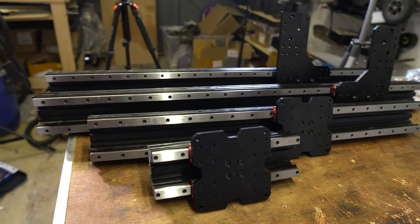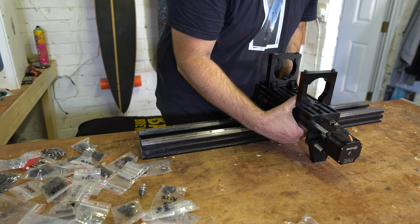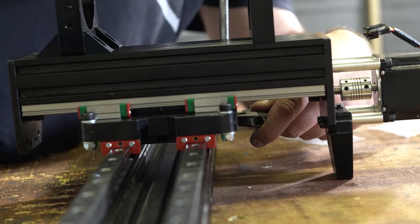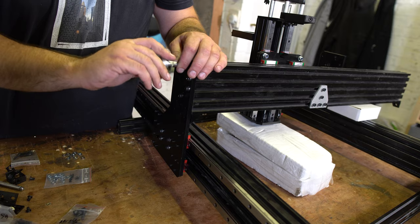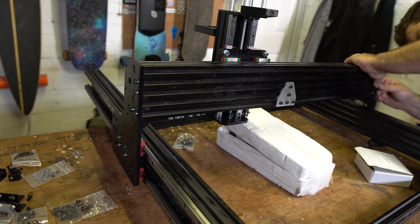Next up is attaching the newly constructed Z assembly onto the X-axis, which you do by bolting two steel plates together with M6 bolts and nuts. It's super rigid — a great improvement over the old V-wheel system — and one of the areas I think needed to be looked at the most on the WorkBee. Rat Rig have clearly thought about this a lot: two steel plates together, there's just no flex in them at all. Attaching this X-Z sub-assembly to the Y plates is quite difficult — the instructions say get a helper. I didn't have one, so I used a polystyrene block to wedge the X beam up whilst I bolted it in.